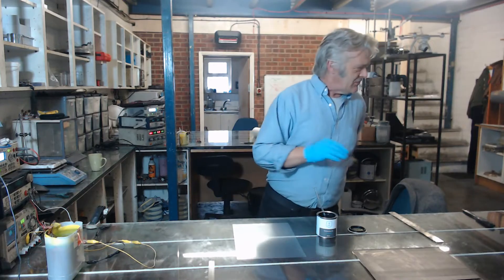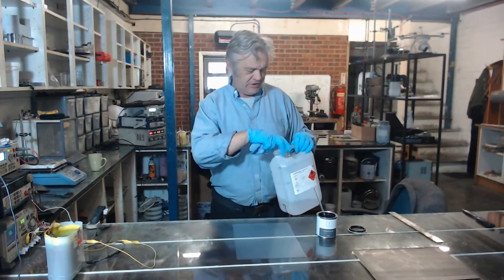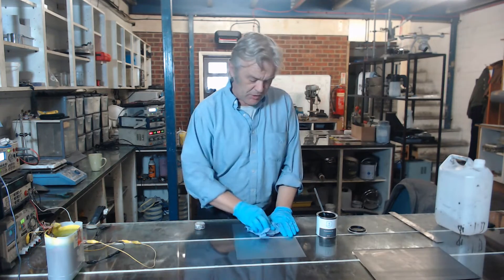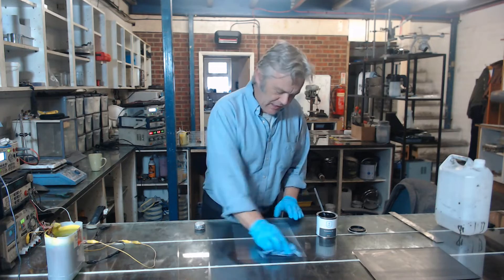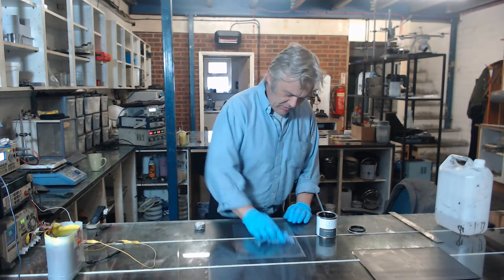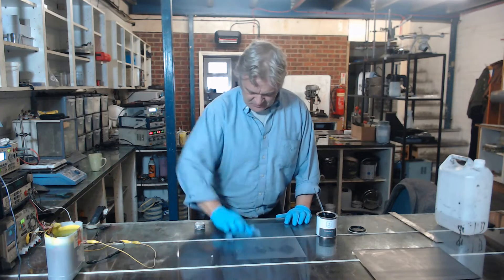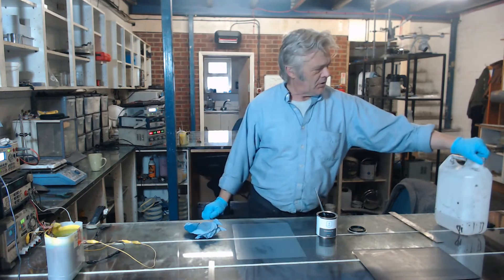It isn't that difficult to coat with our ink. What you've got to do first is clean the surface — it's been handled and is without a doubt covered in dirt and grease. So a little bit of isopropanol alcohol and give it a good clean; that's the first step to applying this ink to a plastic surface. If it will go on to polyethylene, it will go on to anything. There we go — a nice clean bit of polyethylene surface.